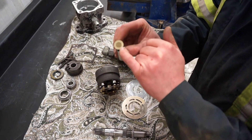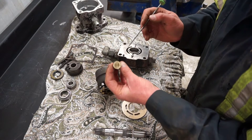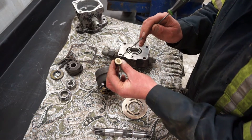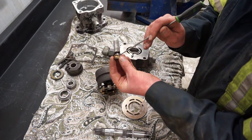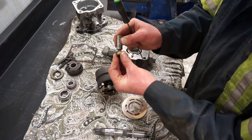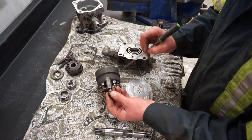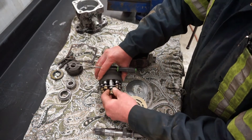The barrel cleaned up beautifully — very high quality steel. Each piston shoe was in rough shape: they were rounded on the corners, which means this was very close to a catastrophic failure. I flattened those out, increasing the surface area for the shoe to push on and limiting leakage, so they should be okay now. As for leakage between the piston ball and the shoe, there's not much you can do about that since they're pressed together other than feel for any play. For high-quality rotating assemblies you have to buy the whole rotating group, and this unit is obsolete anyway.